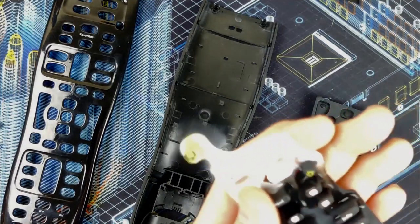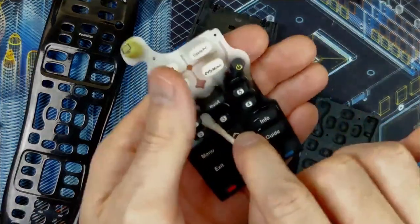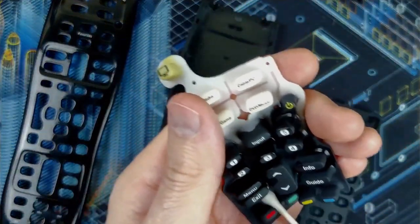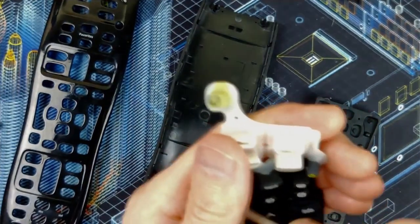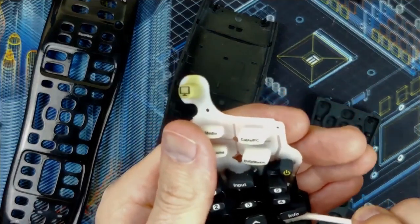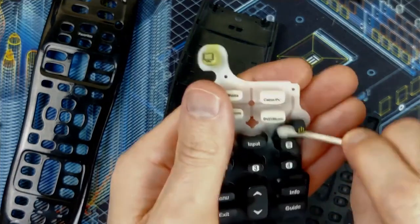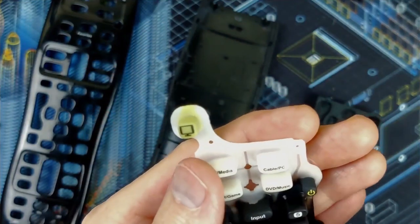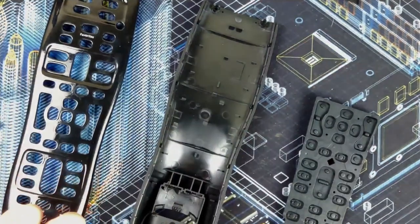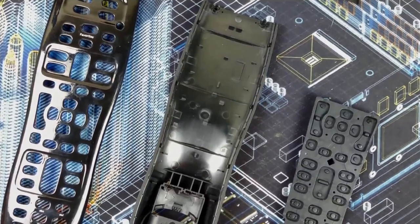My experience over the years, a lot of times that's really all your devices need is a quick clean, some TLC, maybe a reflowing of some solder joints, you know, pretty basic stuff most of the time. And even when that's not the case, it could be something as simple as a capacitor, you know, a quick recap job. Be that one capacitor or all the capacitors on that particular device.